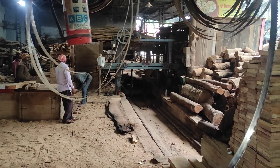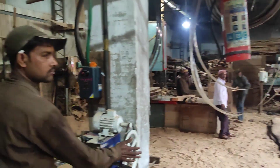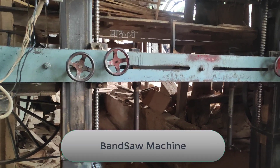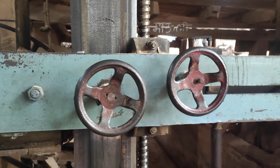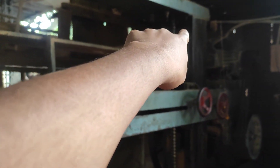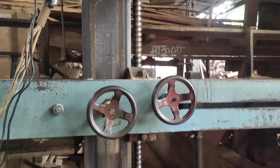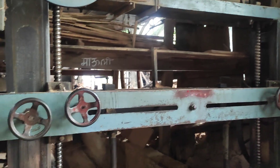There is a transfer trolley and a band saw machine. These are the lead screws — there are two trapezoidal lead screws, one attached on either side. The distance between the two pillars is 5 meters, and there is a cutting blade over there which cuts the wood.